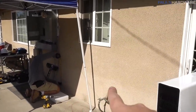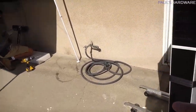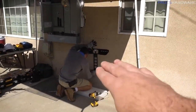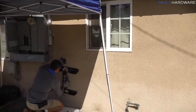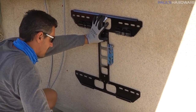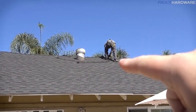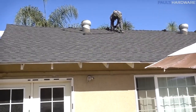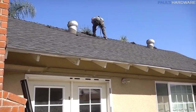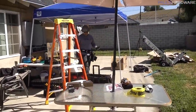They're going to need to run an inverter for the solar grid and that's going to be mounted to the wall right over here. Standards are sort of being developed and updated over time for this type of thing, depending on the city. You're not supposed to mount anything above the battery, and that's why the inverter is going to go over here. When they're up on the roof, they actually drill into the roof and tie in, using climbing equipment — this is all for safety. They did that even during the pre-inspection check. When they're done, they remove the tie downs and patch it over with tar to make it waterproof.